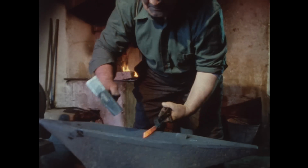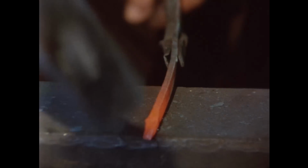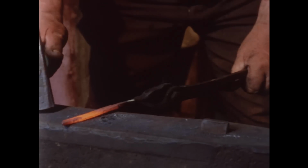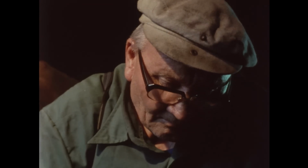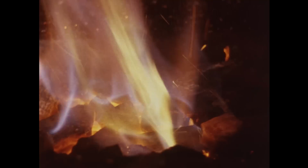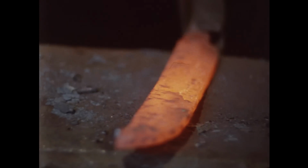The edged steel used for knife making in Kauhava measures 5 times 13 millimeters. The steel is then widened little by little and at the same time made thinner at the back of the blade. Heating and hammering thinner several times produces a much better blade, especially when it has been properly tempered.